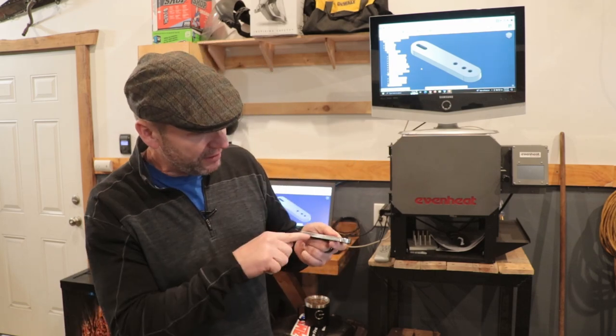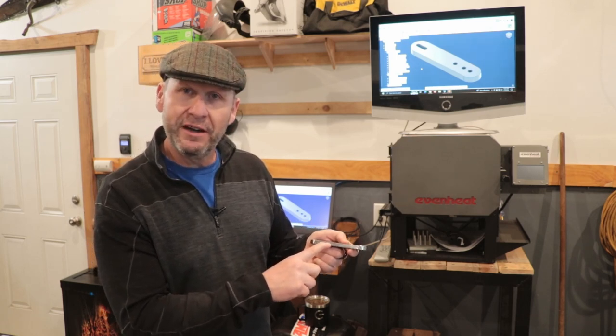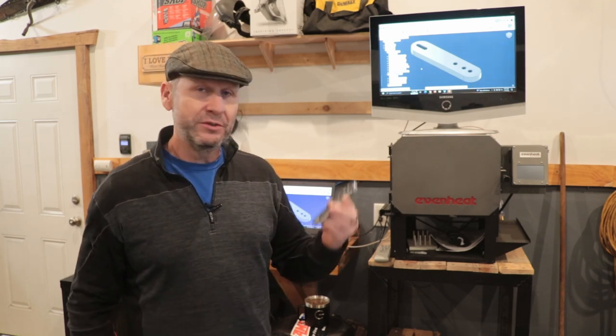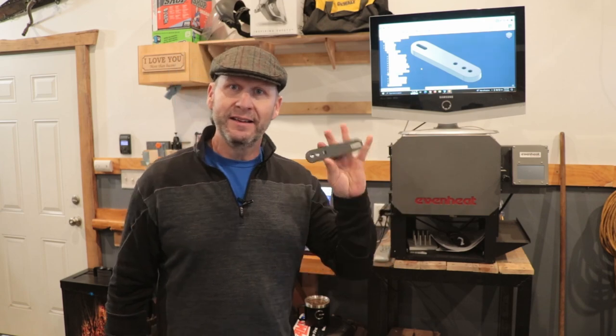Instead of going down 5mm from the top of this contour, I'm gonna go down 5.5. And so it should overlap by half a mil on either side when I flip it. And we'll see how that goes. So let's go ahead and I'm gonna post the NC code, probe it. Let's mill this part.